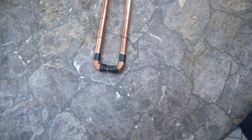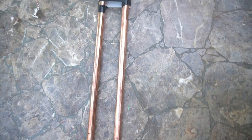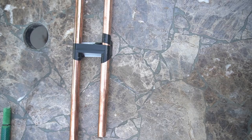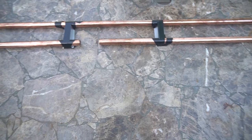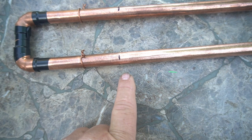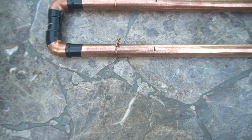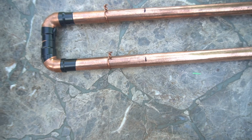I just wanted to show you what I did to tune this antenna before soldering it. I taped everything up, and I also spaced the elements with a couple pieces of wood and tape. Basically I just taped it all together, and then down here I started tuning at this mark right here — that was a measurement I found online. I found a bunch of different measurements online, and to tune it I took these two twisted lines, one here and one on the other side, and moved them down to get it to tune.